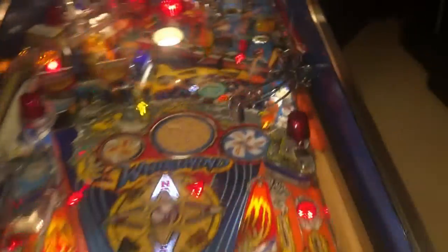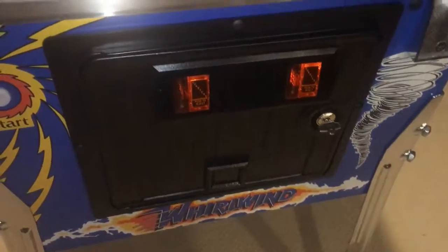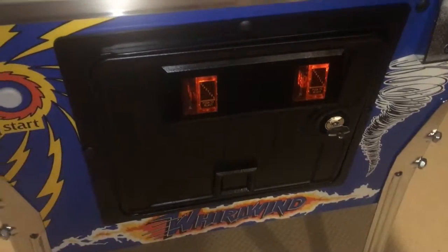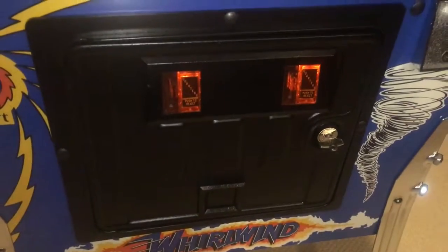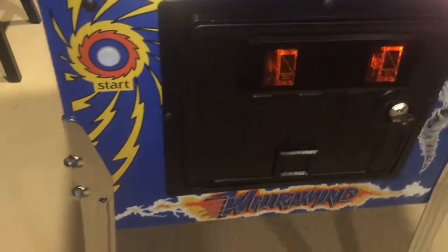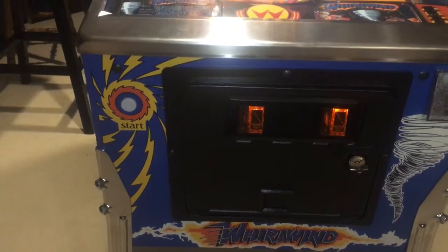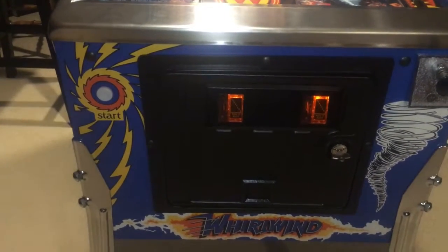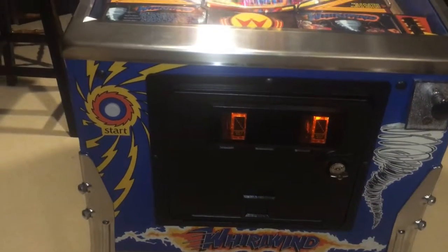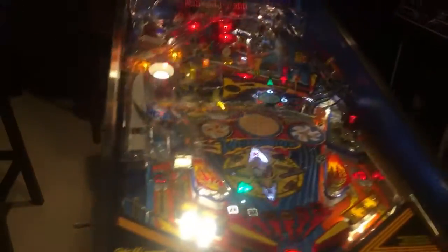whole cab was painted inside and out. The automotive paint. I repainted actually the coin door. This one I just kind of scuffed it up with some steel wool and just went over it with some satin. Actually, it's that Rust-Oleum premium brand that you spray. It has a nice trigger on it, and I just went over that with a quick coat, and because there wasn't much rust or anything like that, it really turned out nice. New legs. So yeah, the game is definitely shining.